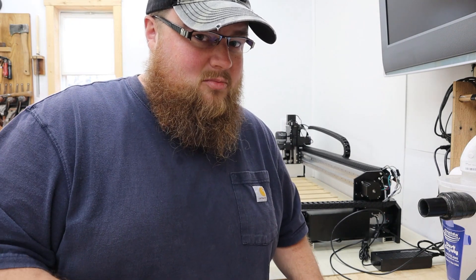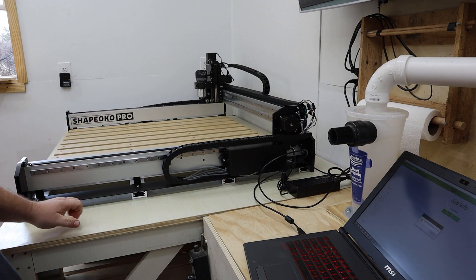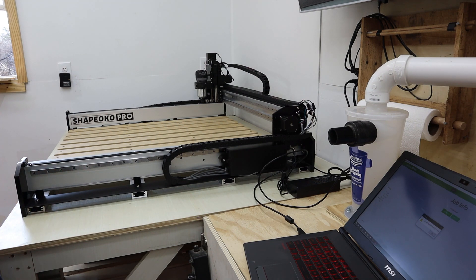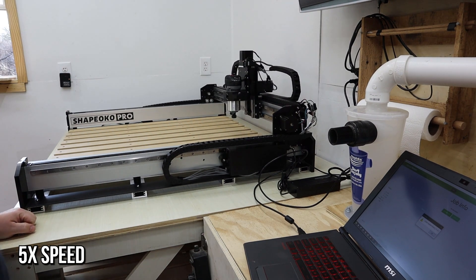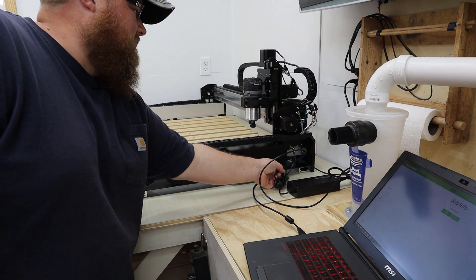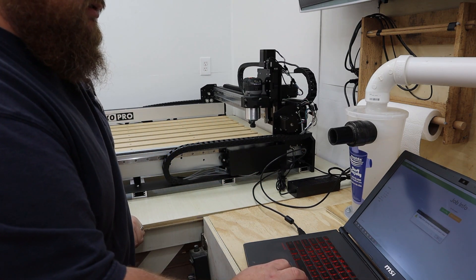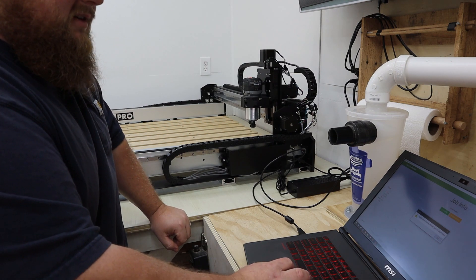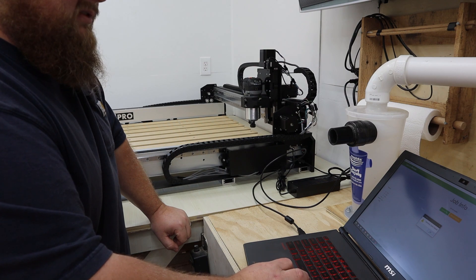Now I'm going to click Initialize Machine again — fingers crossed, hand on the power cord. That sounded bad. GRBL error: homing failed, pull-off didn't clear. Click OK — homing cycle failed again. So I'm going to go back in and check my settings and try once more — still something's off. I'm going to now check my wires and everything to make sure it all looks correct.